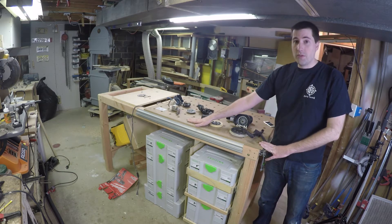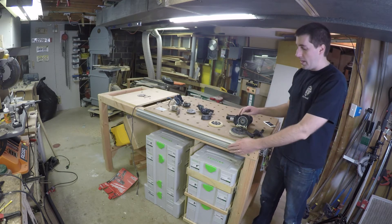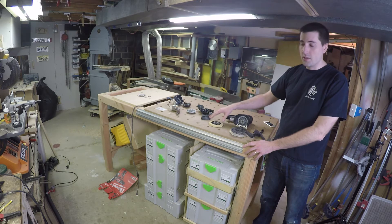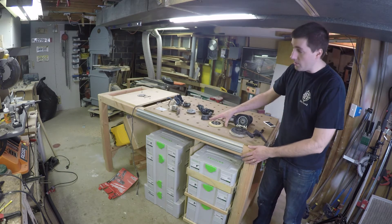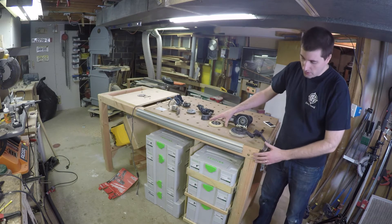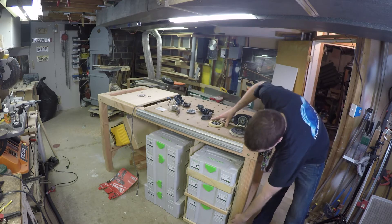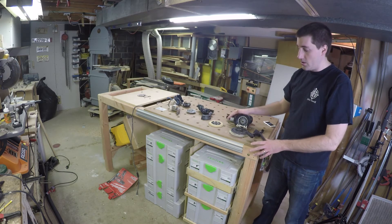What I did is I took the top from an MFT-3 and got the side rails from it, so that would allow me to use both clamps on the side like this, as well as the guide tracks that go across the top. I bolted that onto a 4x4 trestle system, using some big lag bolts in the corners to make it nice and rigid, and down at the bottom to attach the side rails I used some mortise and tenon joints to keep that nice and strong.